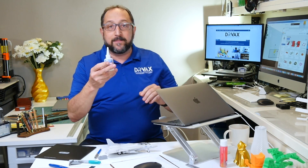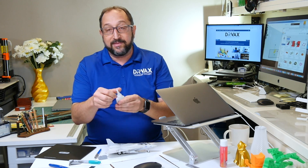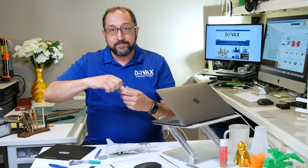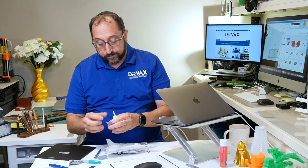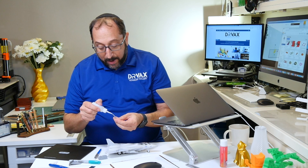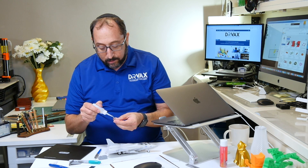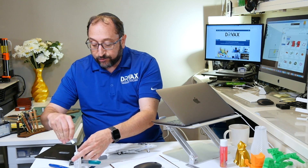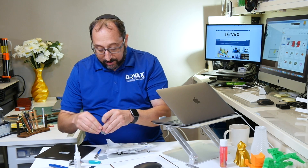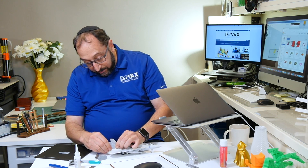Let's finalize this with just a drop of super glue. I have here some industrial grade super glue — I buy this online, it's a brand called Stickfast, and this happens to be the thick super glue. I'm going to put a little bit on the bottom here, alongside this tab, a little bit here and here. The thick super glue gives you a little longer drying time. I'm going to stick that so it looks just about right and hold it there for a minute.